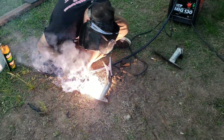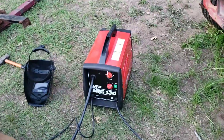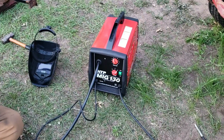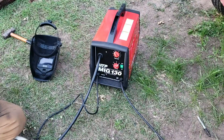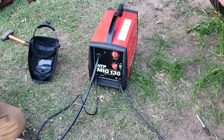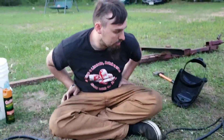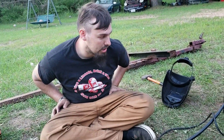Stevo's welding up the other mount, this one still needs to be done. Shoutout to these guys because this welder is a lot better than my janky pile of junk. It's an HTP MIG 130 - I highly recommend it. It's like 400 bucks. You can do aluminum with it too if you put 100% argon in it. I want to build a catch can and stuff with it.